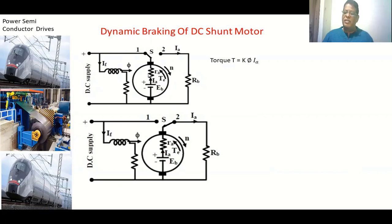When we change the armature terminal to position two, some voltage — the back EMF (Eb) — is generated in the armature. This voltage drives power to an external resistance. Comparing the two cases: in the first case armature current flows into the armature; in the second case it flows out. There is no change in the direction of flux, but the direction of armature current changes, so the torque produced in the armature also changes.